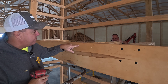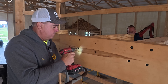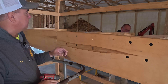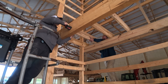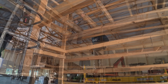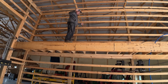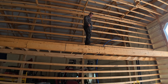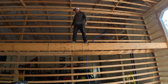I'm trying to drive these timber locks in far enough that the head is below the surface. That brought it right down. That really stiffened it up — about a quarter inch of deflection, which is not bad.